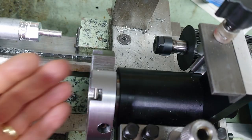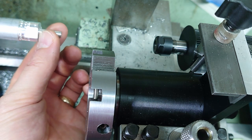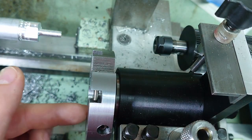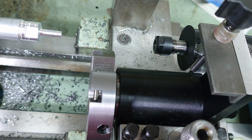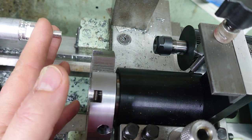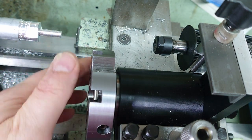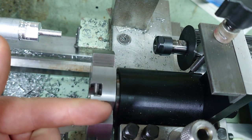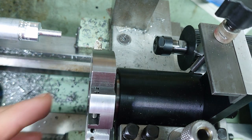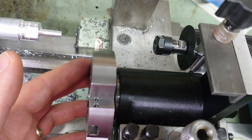Minor point. Of course, the downside with having a collet chuck is that you would have to plan ahead and include a spigot on your part so that you could drive the tool. But with a suitable amount of planning, that's fine. Obviously, there will be certain situations where that's not so possible. It was a quick and dirty way to drive this system without relying on any other infrastructure around the lathe, just on parts that every lathe will have.